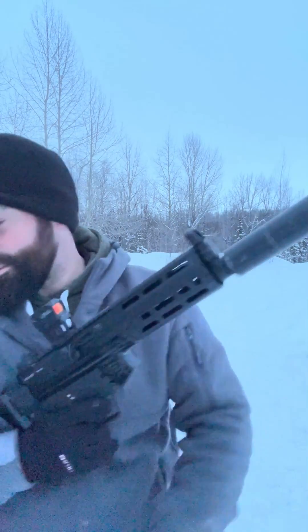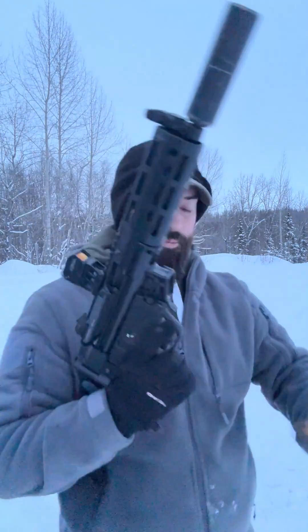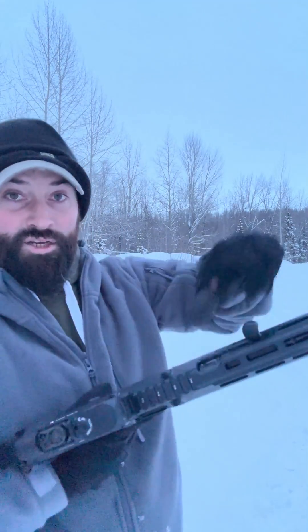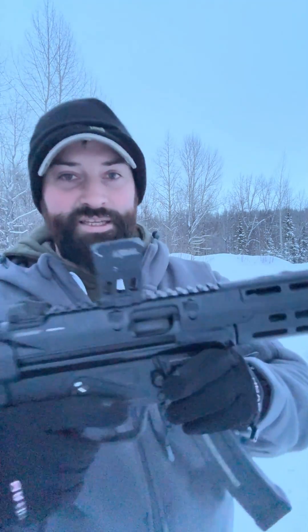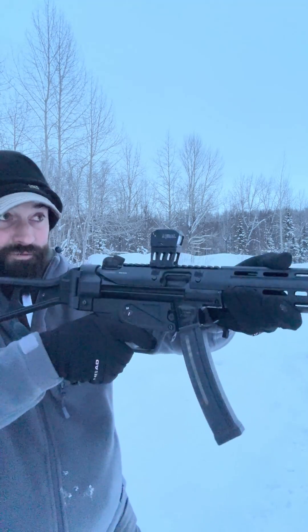But the difference is, if you don't slap this thing, then this is what can happen. If you put the magazine in, charging handle forward all the way, and you load it nice and ginger — soft and gentle — you're going to get something like this. That bolt is not forward all the way, this thing is not going to fire. We are on full auto and it's not going to work because that bolt is not forward all the way.